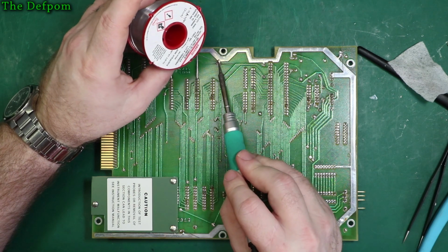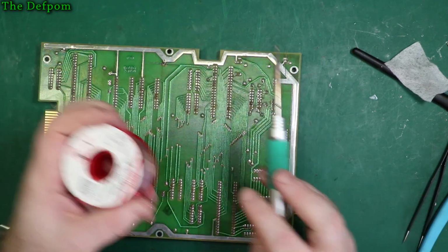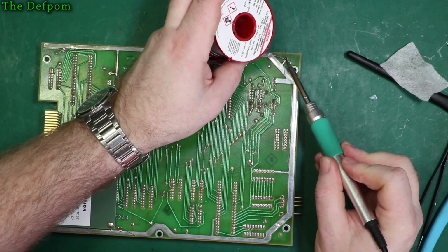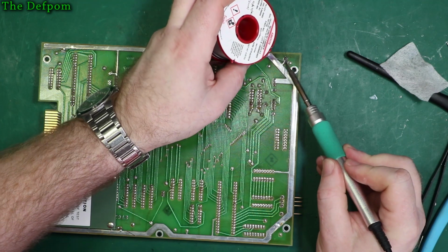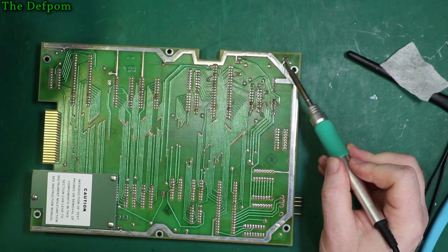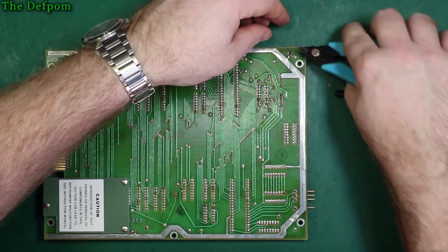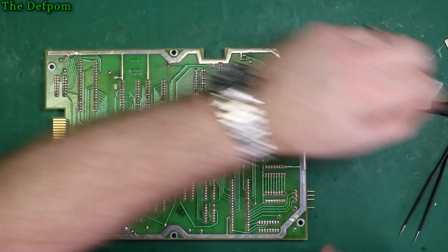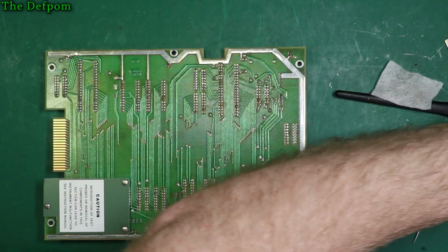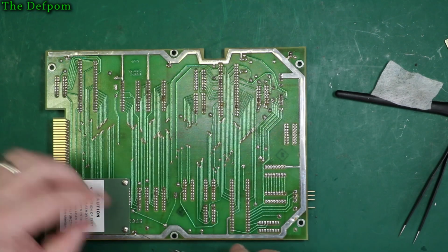So these RF watt meters, they're for measuring RF power. So if you're trying to line a transmitter or something like that, or trying to work on an instrument which has an RF output of some kind, you can measure the actual power output. Within reason, you've got a limited input range, but it depends on what probe you've got attached to it. Usually you have to use a dummy load or an attenuator of some kind in order to drop the levels down if you've got a transmitter. But other things you might be able to use it for testing, like levels inside an instrument as well. Like if you've got an RF section inside an instrument, you can measure the RF level, make sure things are in spec.